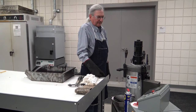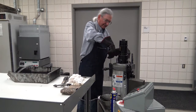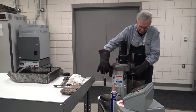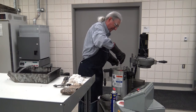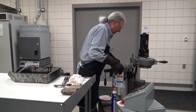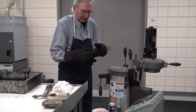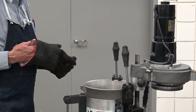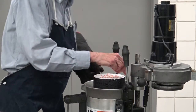There you go. Then it removes the angle, and then it removes the pressure. Once the pressure is back to zero, we can unload it. Take the top plate out. Now we extrude the specimen from the mold. To do that, it's going to put this back on — all this is for is to hold the mold down as it presses the sample out. The ram comes up and pushes it out of the mold. The head is out of the way, the mold is held down. Remove the top paper.